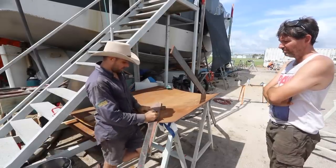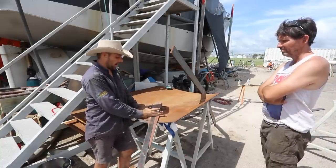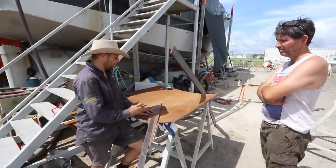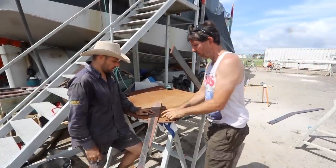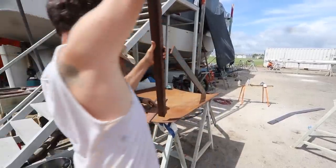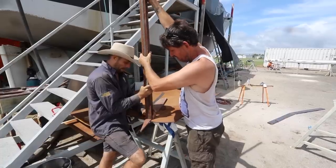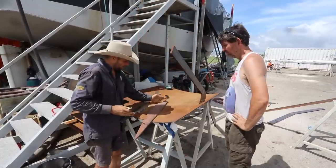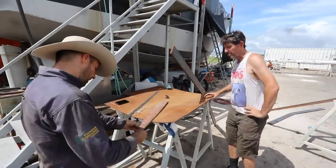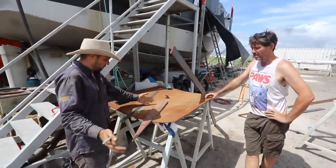That's our centre line. If I put one, say, there, that end of the arm is going to be taking the bulk of the load, and that end of the arm, it's still going to spread it, but it's not going to be perfect. Yeah, and then if you came that same distance and put a 50mm one there. So the plan is to do it like that. Yeah. Weld it in. So that's pretty even, roughly. And then we've got a piece of flat that comes in here like that. I like that. That's good. I mean, that's pretty spread even.